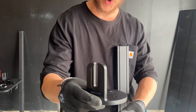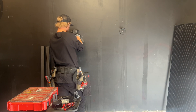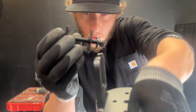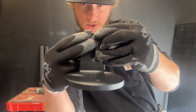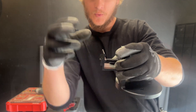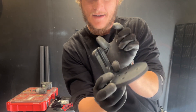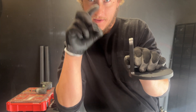In this video, I'm showing you how solar panels are attached. You have a bracket, a foot that mounts to the structure. Next you have a saddle that goes onto the attachment and can be fastened with a screw. And then the rail clicks inside of this. Some manufacturers will just have a bolt, but it's pretty universal: a foot, a bolt or a bracket, and then the rail.